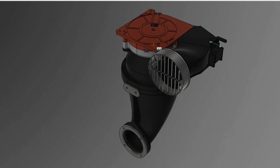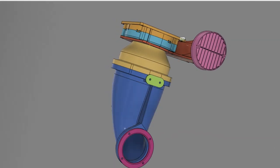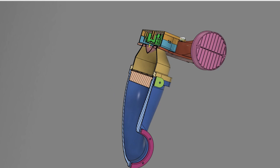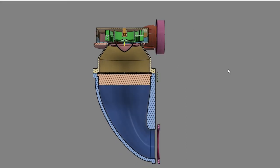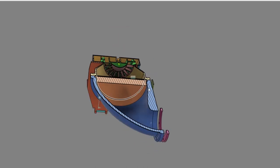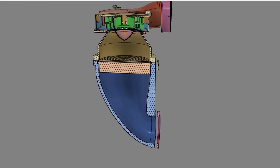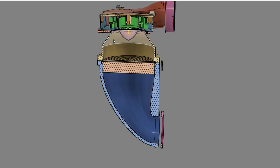I think it's easiest to actually look at this design in CAD so you can see what's going on inside the filter and plenum housing here. The air inlet is located here at the bottom of the enclosure where it will pull in cold air from below the printer. I used a round off-the-shelf HEPA filter meant for a vacuum cleaner as the initial filter stage to remove any particulates. The second stage attaches to the first stage with four 4mm bolts and some brass heat stakes. I found it was very difficult to take apart the way I had this oriented, so the one I'll upload onto Printables has the bolts on the bottom, which is much easier to access.